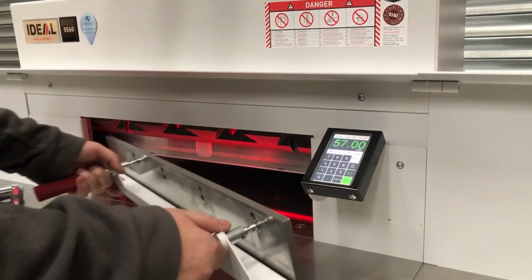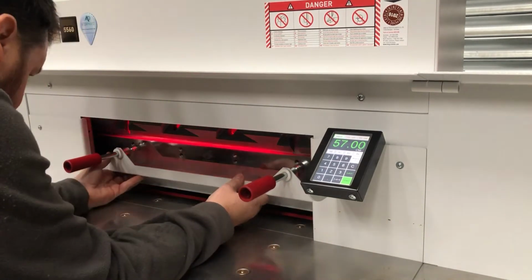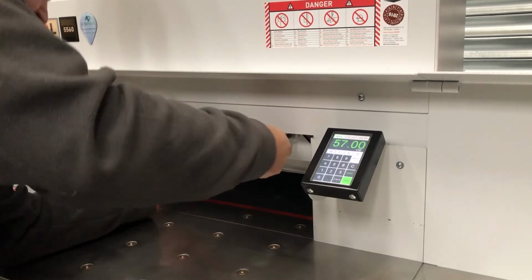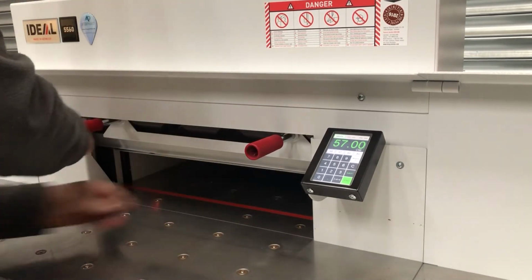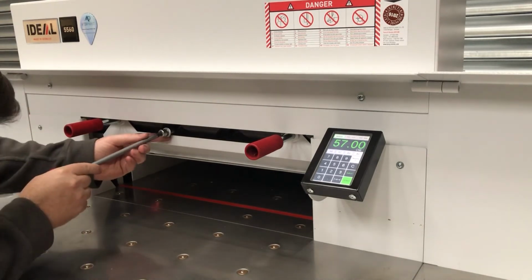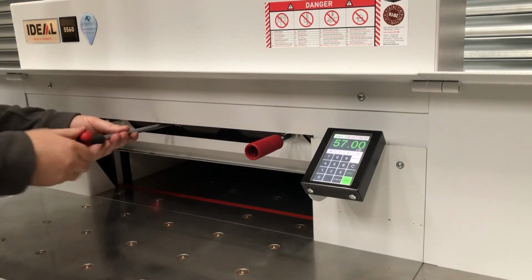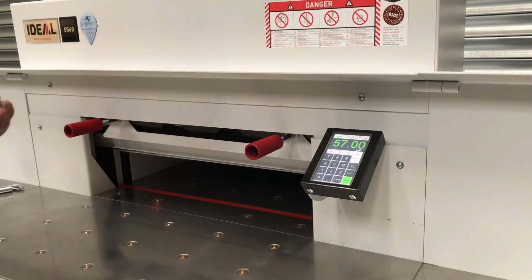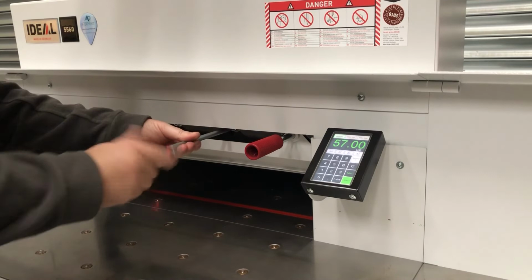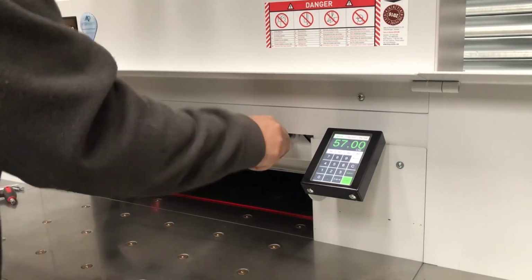Okay, so we bring the blade into the machine on the left, over to the right, and then offer it up into the slots. It goes all the way to the home position. Hold it with our hand, lock it in position. 8mm Allen key. Into the blade, the bolt goes. Just nip it up, doesn't need to be very tight at this stage, just nipped up is fine. Nip that one up too. Remove the cradle.